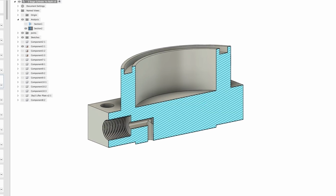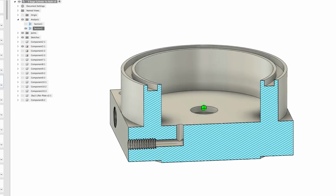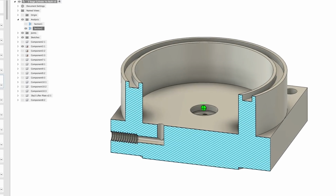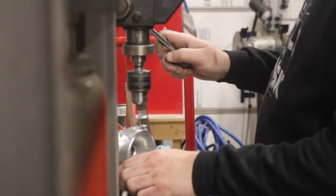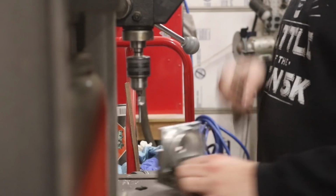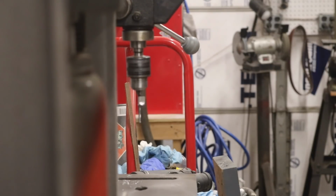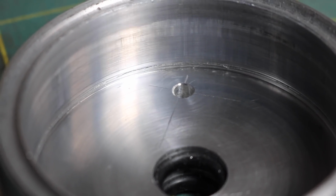The plumbing for air inside the cylinder looks way more complicated than it really is. In practice, I was able to lay it all out by hand, and then I just drilled it all on the drill press. I even used the classic redneck depth stop, aka a piece of tape or a Sharpie mark, on my drill bit. Now, it's worth noting that while I was building these parts, this is the short period of time I did not have a motor on the mill, hence all the lathe and drill press work.